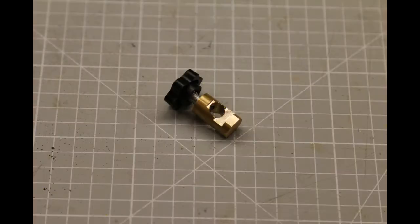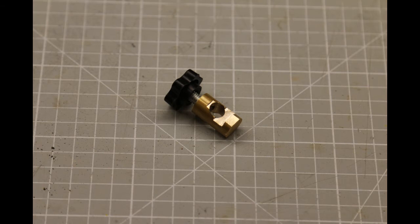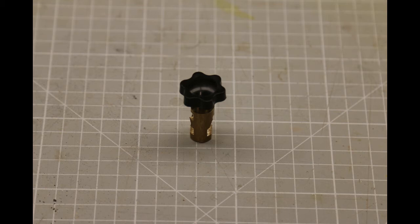A small piece of brass was machined with a slot and a hole to fit the 8mm bar of the accessory. I milled this, but it can easily be done using hand tools — it's pretty simple as you can see. A 6mm thumbwheel, available on Amazon or eBay, clamps it in place.